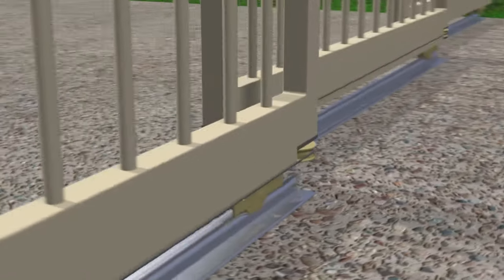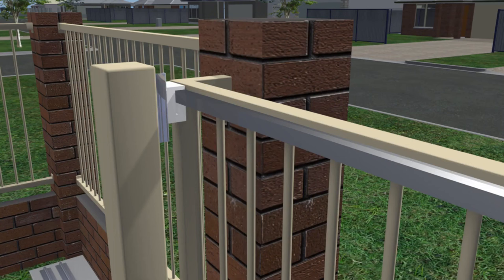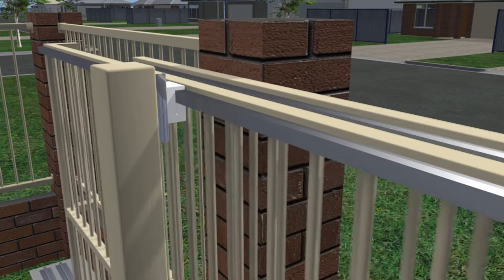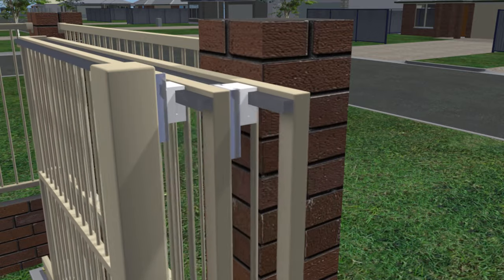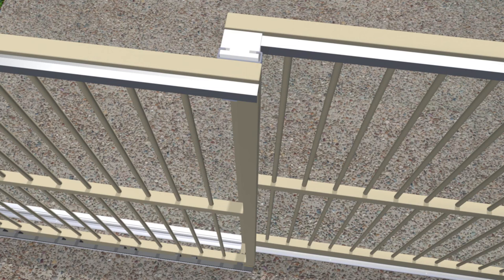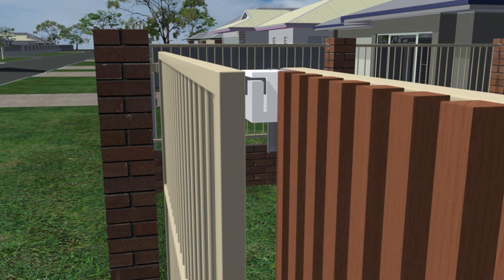The guide system uses standard block, channel, and rails, with one fitted between a guide post and the back panel, and the others fitted between the panels. The guide block and its channel are 80 millimeters wide, so they fit nicely into the overlap between the panels. If a 32-millimeter wide guide rail is used and the guide channel is fitted to the front of the back panel, there will be a gap of 81 millimeters between the panels.